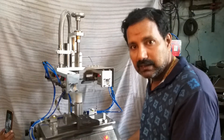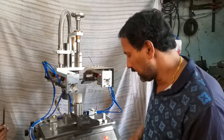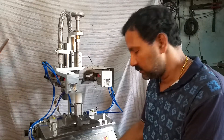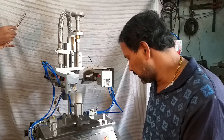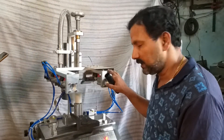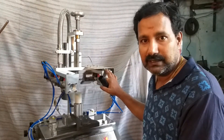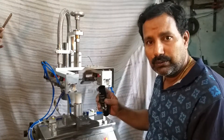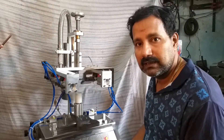It is an electro-pneumatic tube sealing machine with a dedicated control panel with microcontroller. Controls like temperature control, timer control, and product counter are provided. There are two stations in this machine: the first is the heating and sealing station, and the second is the trimming station. Trimming means the tubes are cut to a straight line after sealing so that they look better.